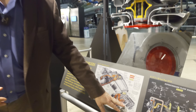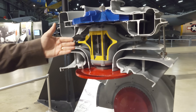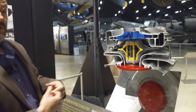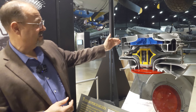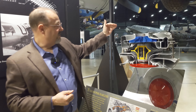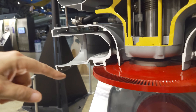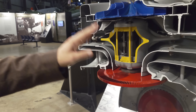In the case of the B-17 and some other Army Air Force aircraft, the air was actually compressed twice. It was first compressed with a turbo supercharger — we see this system here. The air comes in the leading edge and goes to the turbo supercharger, where this impeller — basically a compressor — compresses the thin air at high altitude to maintain the engine's horsepower that would otherwise be lost. On a turbo supercharger, the impeller is driven by engine exhaust via a turbine wheel, spinning at about 21,000 RPM on the same axle.